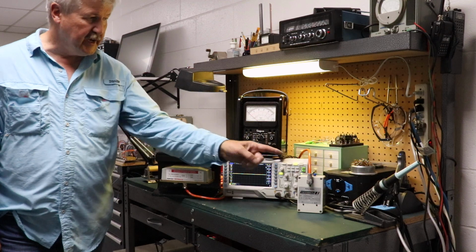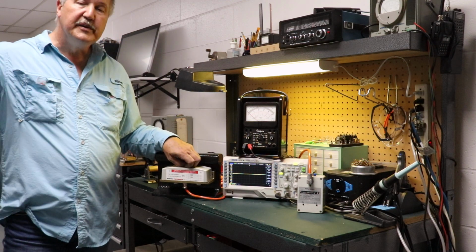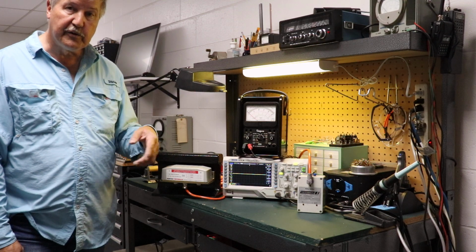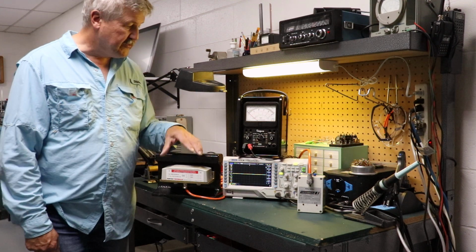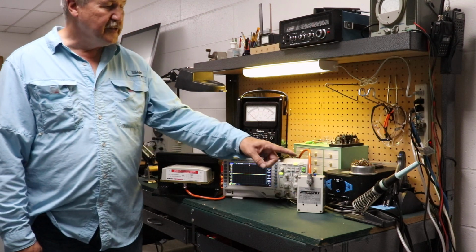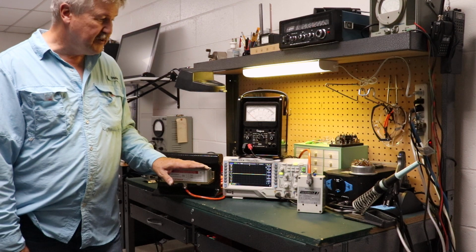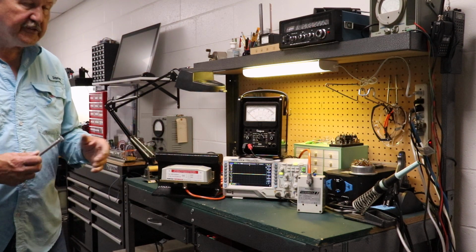In other words, you can't have this connected to the sensor at the same time it's talking to a relay house or a yard or tower and communicating also with the G84 or G94 switching amplifier module. So again, disconnect the sensor electrically from the field, from the infrastructure, and connect this in its place by matching the 4 colors, brown, yellow, green, white, and you're pretty much ready to test. So what I'm going to do now is go ahead and adjust the sensor.